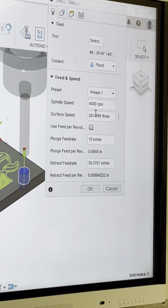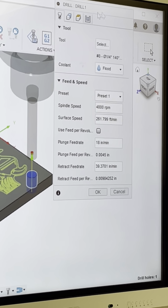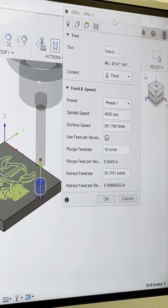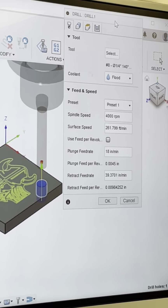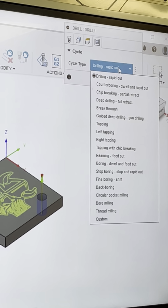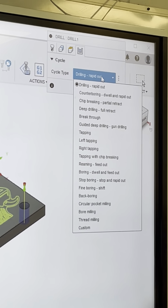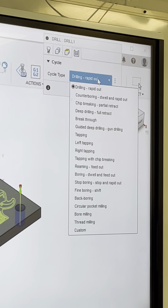It can walk, okay? We're not gonna do any center drilling or anything like that. I got a 1/4 inch stub drill out there, which is a little bit shorter drill bit, so it doesn't walk as much. So we're gonna try to take that cycle of center drilling out. You see what I'm saying? We're gonna save a little time there, you know what I mean?